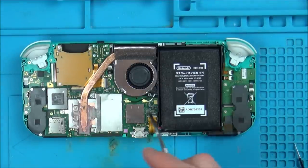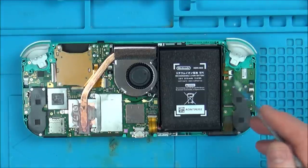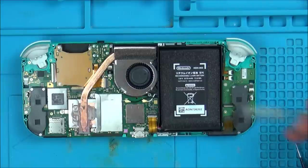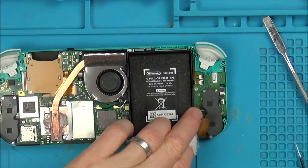So I can see corrosion here, and then the backlight connector is here, so it must travel from this board down here into here, unless there's something on this board that deals with the backlight, but I don't think so. I reckon this is just like a pass-through. In fact, let me see if I can have a look at the connections from this backlight. Here we go, there's water damage on them as well, I think. And water damage there. Yeah, let me zoom in and show you. But yeah, the tracks do go from here down to here.